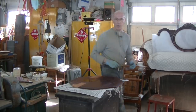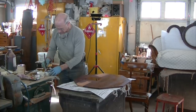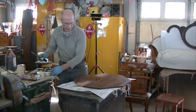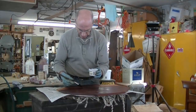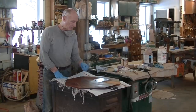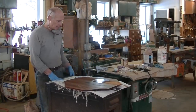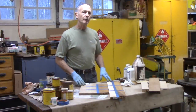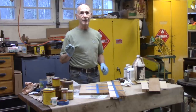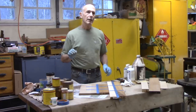It doesn't look that different, but I'll add some more. I added a lot more of the dye stain — let's see what happens. Even though at first it doesn't look that different, I think I'm going to do this larger area with this new stain, let that dry, and then put some clear finish on it. The secondary coat has dried for about 45 minutes — that's the minimum for these stains. I think it looks really good, better than the first stain. The oil stain wasn't giving me the exact right color, so I added dye stain to alter it — and that's fitting because really in my work I use mostly dye stains.